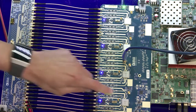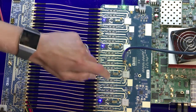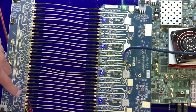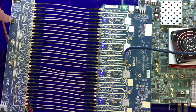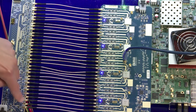The HMC7043 delivers SysRefs and FPGA clocks needed for the platform. Also connected is a calibration board, which is also available, to elegantly loop back signals at various places along the signal chain. This calibration board is controlled via a PMOD interface or DIP switch for ease of use, to switch between single-channel or combined performance testing.